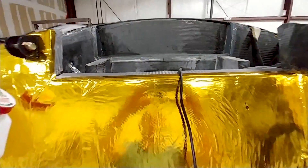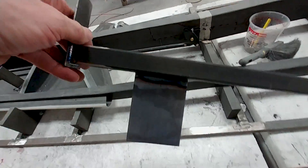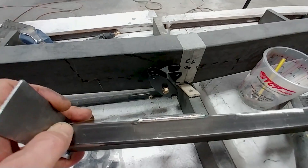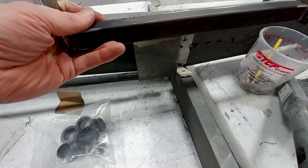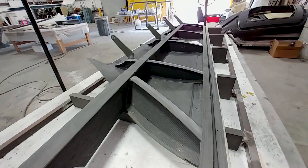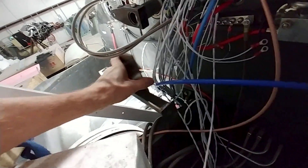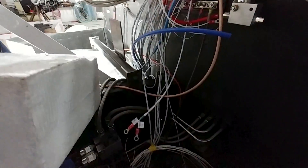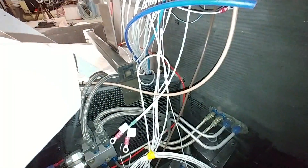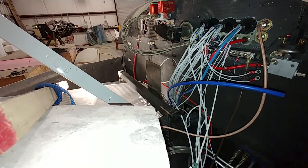Here's the intake actuator with holes drilled and click-bonded — Jeff and Devin have gone and bonded that into place. Britt has welded up this little supporting bracket: the main bell crank for the elevator now has an additional support so it can be in double shear instead of single shear. It's a one-by-one square tube with flat plates on either side that bolt to the existing structure. That flat plate will get a hole to match up with the bell crank for extra support. We'll drill those holes and get it lined up probably next week — Britt threw that together very quickly.